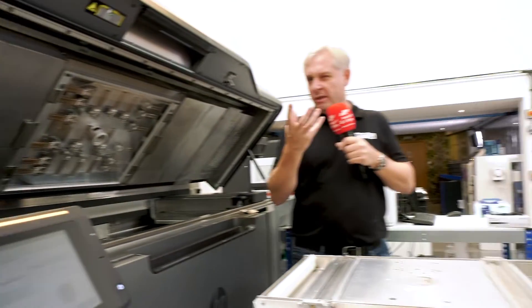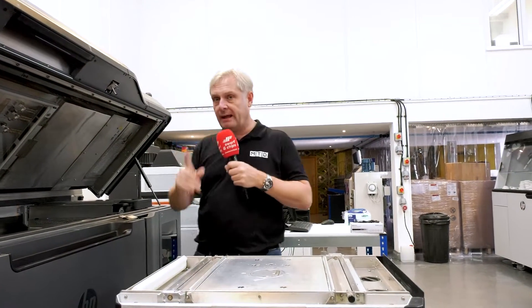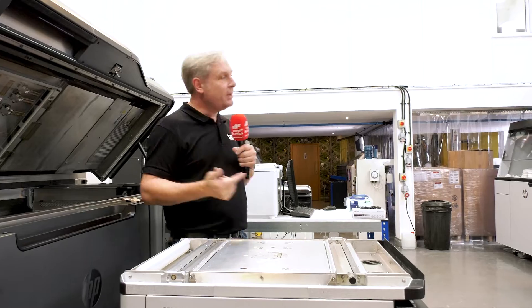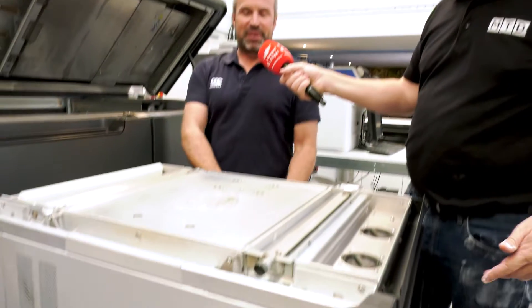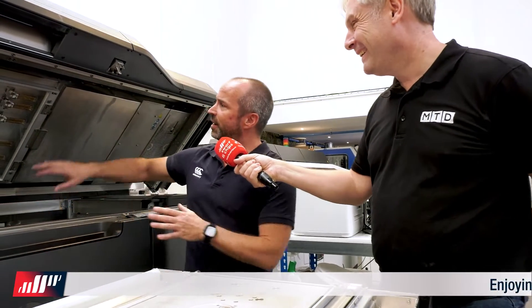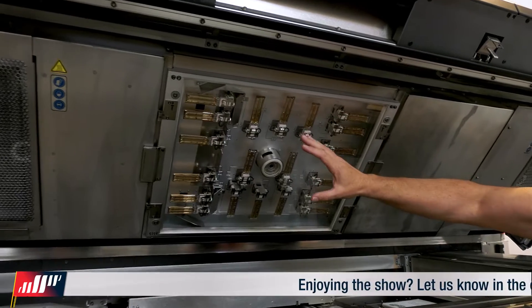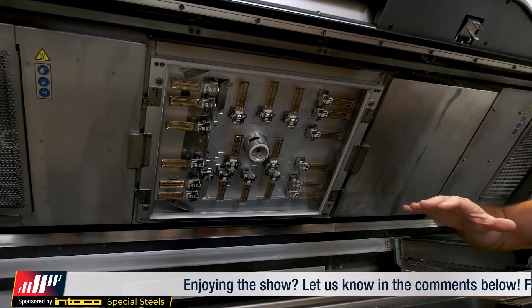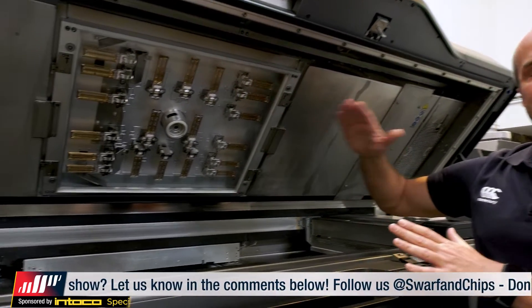I want to know the technology. Because if I'm thinking 3D printing, I'm thinking layers like my inkjet printer, or I'm thinking lasering - but that is not correct. Give me a very quick lesson on the technology going on in here. Build units here, which is now full of nylon powder underneath - PA12 - pushed in all the way to the back there. Printer's closed, we start the build. The build starts with heating lamps in the top which raise the whole system up to just underneath melting point for the nylon. Then we layer in nylon at 80 micron thick layers.